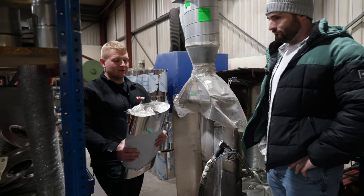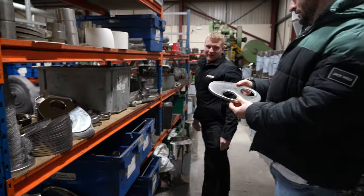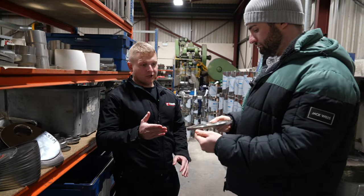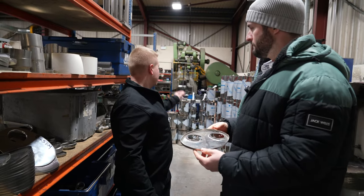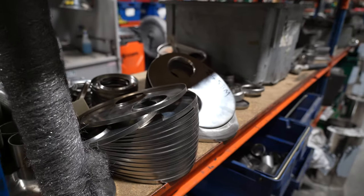The next thing we need is some end plates, because obviously you can't go selling it without them. This is an end plate — it's got numbers on it. This again comes in as raw sheet. That massive press in the background is a 500 tonne press — we use that to press the end plates. And then there's a little press next to that which we use to punch the holes in the end plates as well.